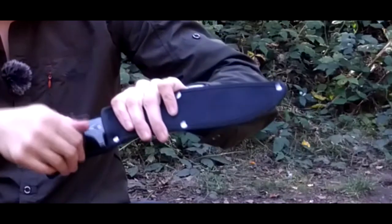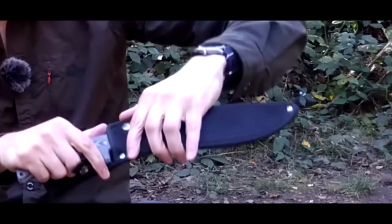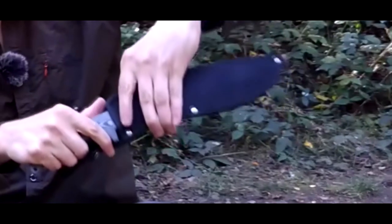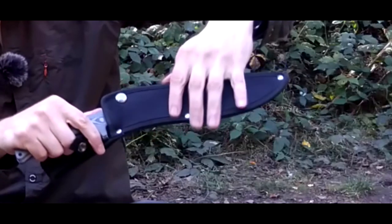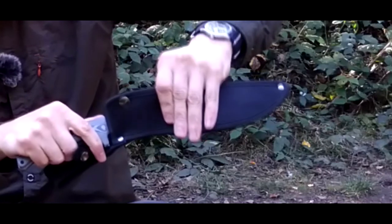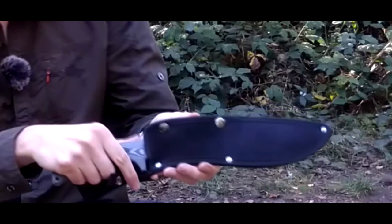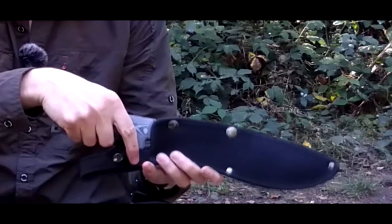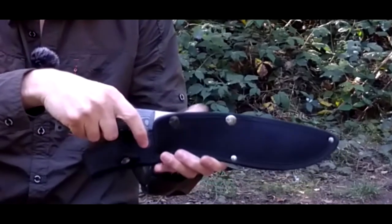I will link down below in the description a very interesting video about sword making, but it does apply to knife making. To summarize that video, when making a longer bladed product, you would want the handle to be softer so that it absorbs shock and it overall makes the tool stronger. This is relevant to the Anglo Arms Kalahari because I feel that it is uniformly hard from the tip to the butt of the handle.